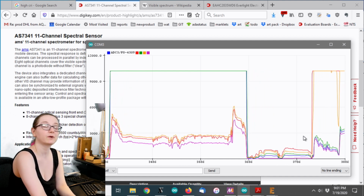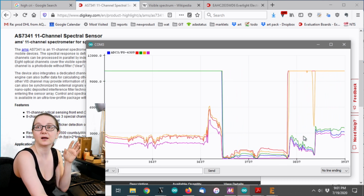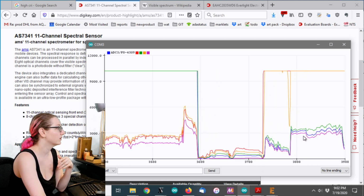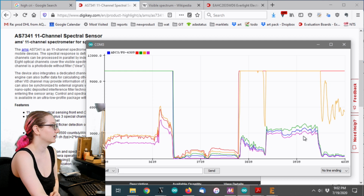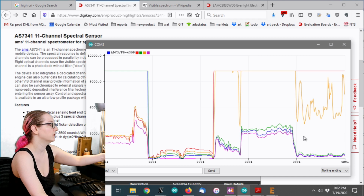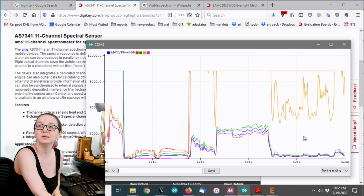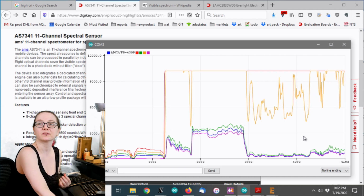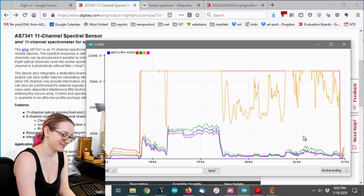This one is a red LED, but you'll also see a lot of orange in it. That's not uncommon. Most low-cost LEDs have a bit of a spectral spread. So the orange diode is also picking up some of it. If I back it off a little bit so that I'm not saturating the diode, you'll see that there is a lot more red than orange, but there's still quite a bit of orange and almost no green, blue, or purple. What's the measurement? Is it kelvins? It's counts. Anytime you have a color sensor, it doesn't give you like the Pantone shade, it just gives you the counts, like how many. Like the count from Sesame Street? Yeah, basically. One red LED.